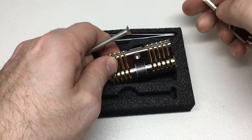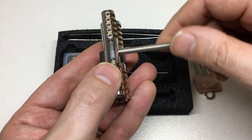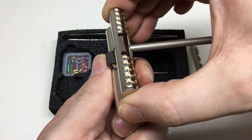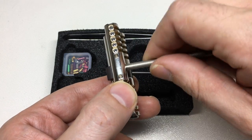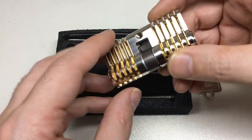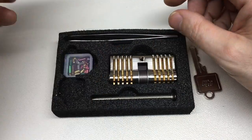This is a nice addition I didn't expect to be in here — this is the actual mounting screw. If you put this into an actual door, euro cylinders all come with a screw like this that goes in from the edge of the door to secure the lock in place. Why do they include it? Well, for completeness naturally, but also if you have a practice rig where you mount these locks, you still need a screw to fix them in with. After all, this BKS euro cylinder almost certainly would have come with one of these in the pack anyway, so why not include it.